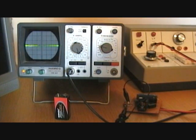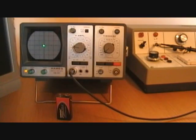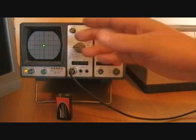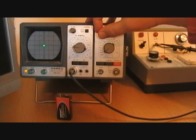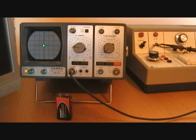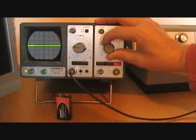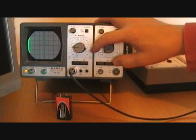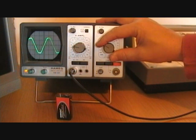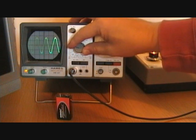Let's turn that off — here's a quick recap. Some summary notes for the oscilloscope: a screen with a graticule marked in centimetre squares and a dot formed by a stream of electrons which we can move up and down or across the screen. We've got a Y amplifier which determines how many volts are displayed on the amplitude of the signal, and a time base control which determines how fast we move the spot across the screen. Applying an alternating current gives both positive and negative signals, and we can expand the waveform to see as much or as little as we want.